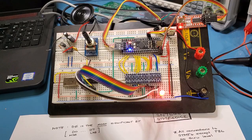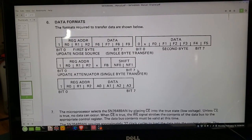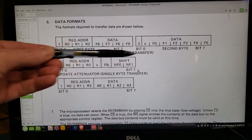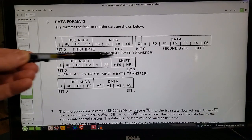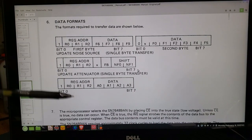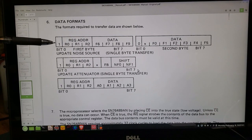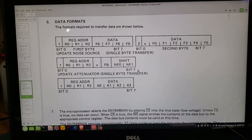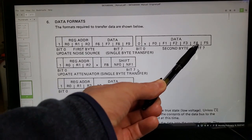As I usually do, I've built the code using the STM IDE workbench, and all the code is up on the GitHub repo link below. Let's look at how the IC is programmed. There are three basic interfaces available: the first is the primary interface used to set the channel and tone; the second deals with the noise source; and the final interface is the attenuator, which is used to control the attenuation for each of the channels. The first interface is a double-byte send that sets the tone for a given channel — the register address contains the specific channel: zero for channel 0, two for channel 1, and four for channel 2 — followed by 10 bits of frequency information.